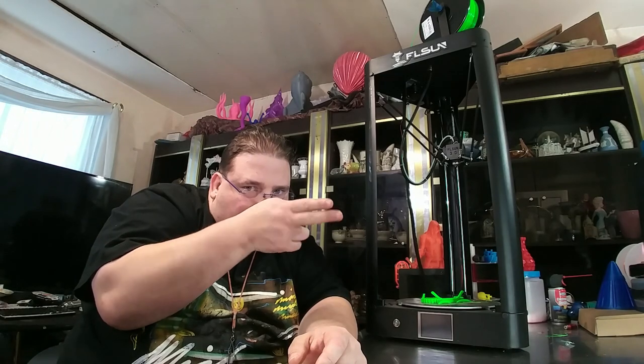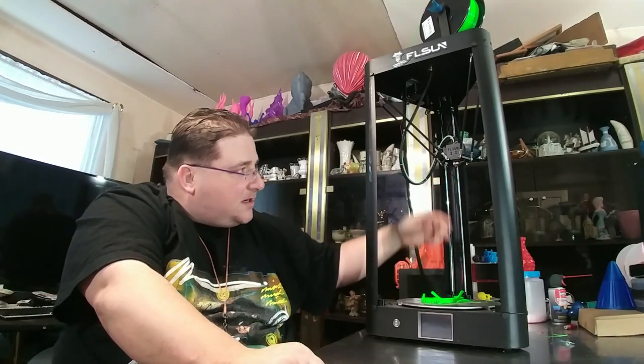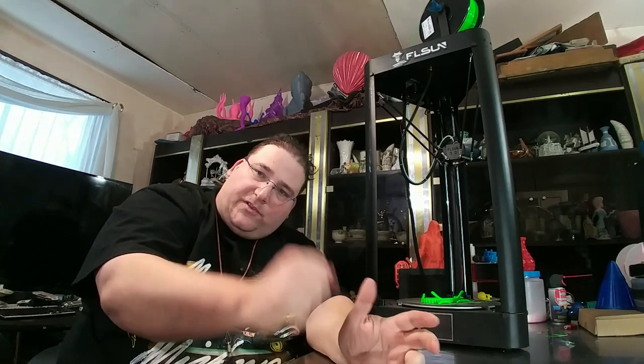He spent like 2.5 hours on Skype with me, working with me on this. Thankfully, I have a multimeter and I could give him good information. It turns out that during assembly at the factory, someone had accidentally reversed one wire each, just these two wires. And because they'd reversed those wires, the circuit that's supposed to provide 5 volts to complete this contact was turned off. I guess if it detects a fault, it switches and turns off.